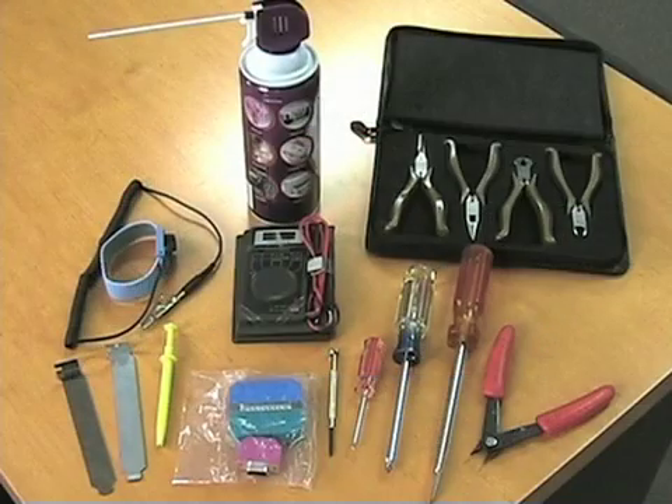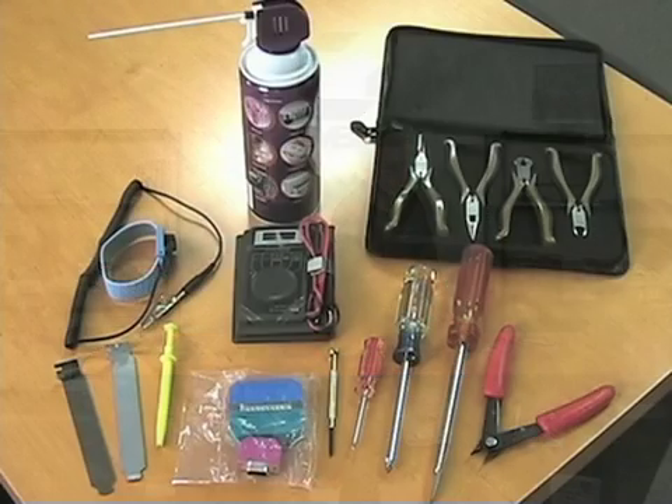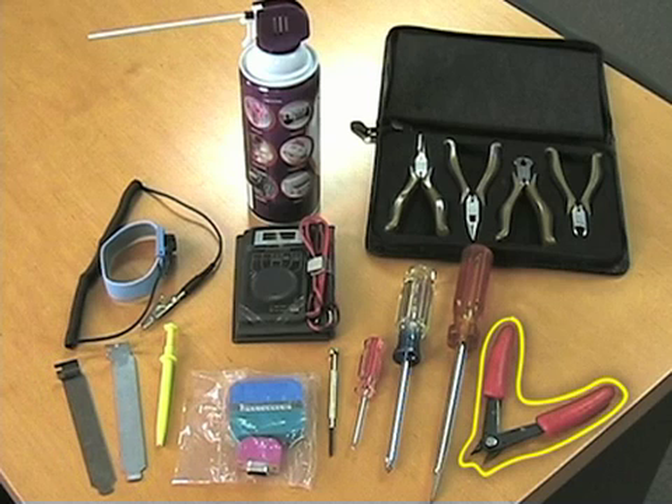So take those with you. Also take a good set of loopback plugs — highly recommended for working on diagnostic equipment, making sure that everything's working okay. If you do need to pull a card and replace it, carry some blanks with you as well, as well as a good wire cutter, something that will cut through just about anything. You'll find that to be quite useful.